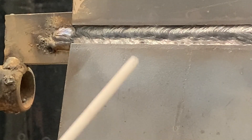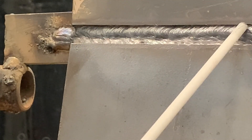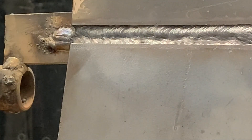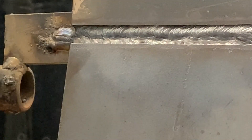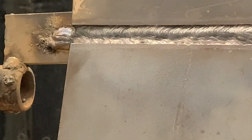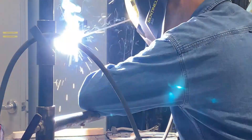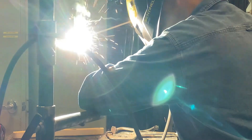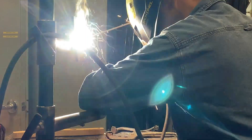I'm in good shape to start capping. One small concern is that I'm a little lower on one side than the other, so I'll go slower in the beginning and speed up toward the end. It's important to bring the fill just under flush with the plate so we can do a nice quick cap in four passes. I ended up sticking on the tab rather than in the beginning of the weld, which is a good thing. This first cap pass will go a little slower and serve as a shelf for the rest of the passes to stack up on.